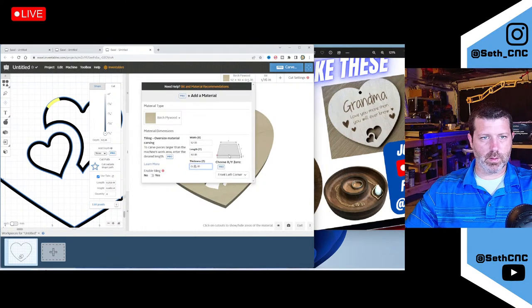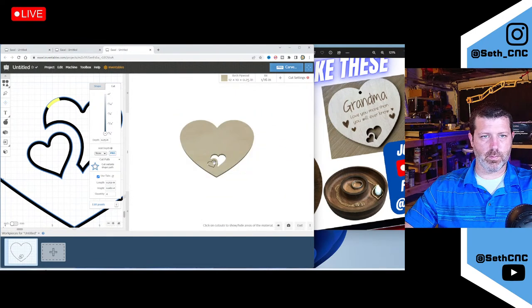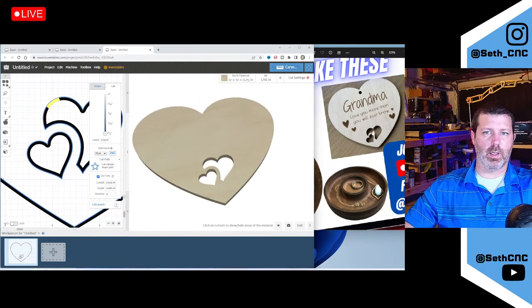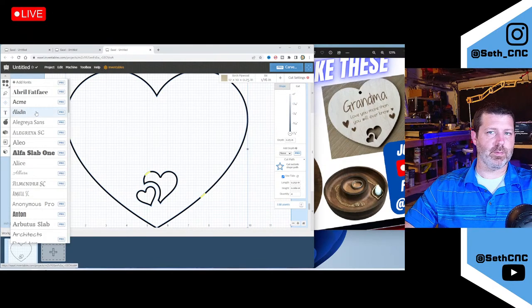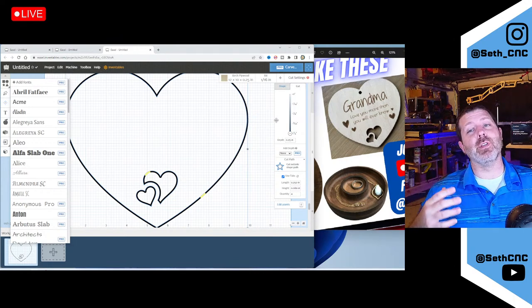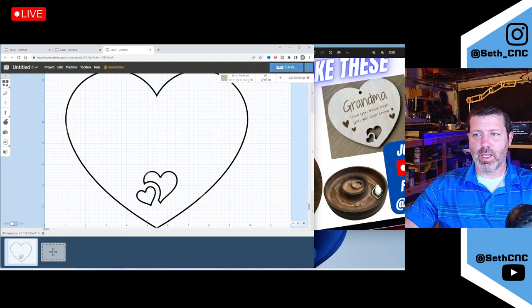Because this was cut with a laser and ours will be cut with an end mill, there's a little bit of radiusing that occurs inside the corners — something to be aware of. We can switch to a smaller end mill to minimize that. Using the product preview it looks pretty close to the original. For the grandma text on top, you'd really want to use Inkscape to create the SVG of that text and then import it in.